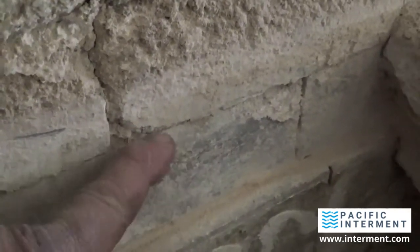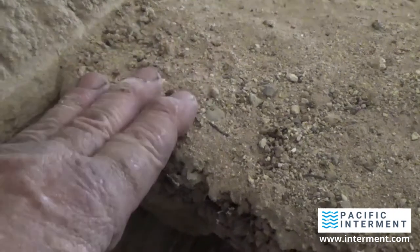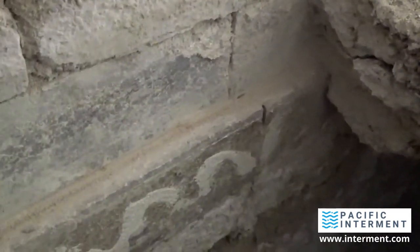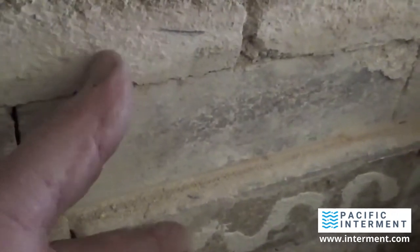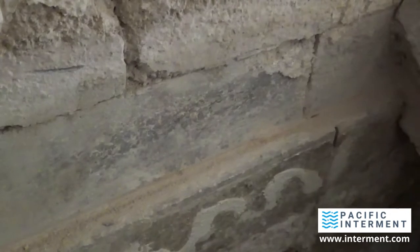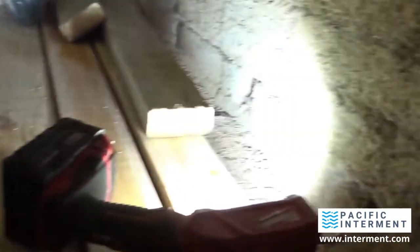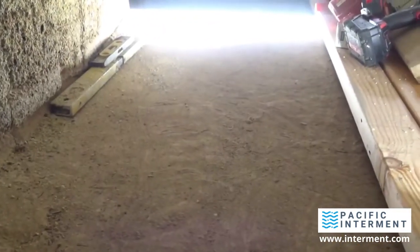This edge where the floor sits to here is the actual floor. It's going to come into the old floor and I'm just going to lap it over a little bit — it'll hold just fine. We've done this before, it's not an issue. But I do need to put forms underneath before I can pour. You're looking at about this area here as the width of the new floor that's going to get poured — going from back here where the floor collapsed to the front. The rest of the floor is actually in pretty good shape; it's holding up just fine. It only really needs to last maybe another five or six months, and then we're going to tear the whole thing apart and put it back together brand new.